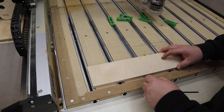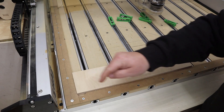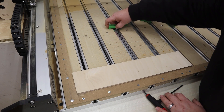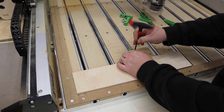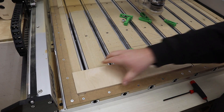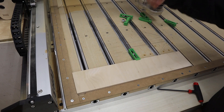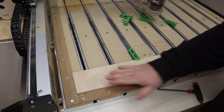The cool thing about having a fence, and the real reason that they're beneficial, is it allows you to not only have a set zero point or origin for your pieces that doesn't ever move, but it also allows you to clamp your pieces down faster and with fewer clamps. At this point, all I need is just one clamp at the top, cinch it down, and that piece is not going anywhere. It's locked in against two full lengths of the stock on a reference, and it's got this piece holding it down and pushing it forward as well. For 99% of the jobs, this would be fine.